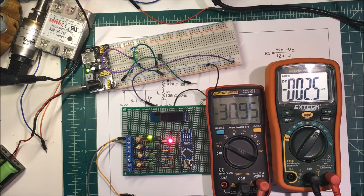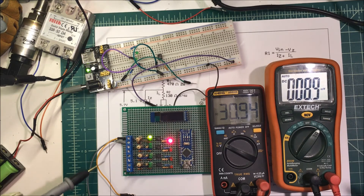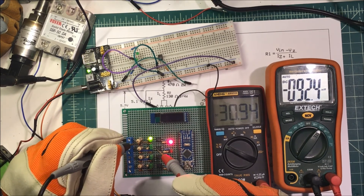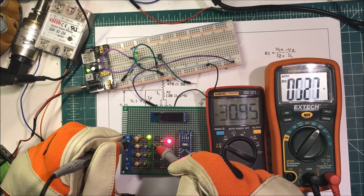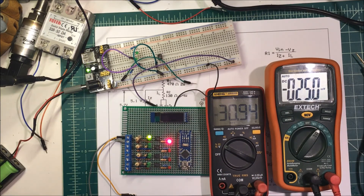All right, here we are. I've got almost 31 volts input and I'll see what we have across the Zeners. It reads 5.8 volts — the Zener diodes do have some internal resistance you have to take into account. Now I'm going to lower the voltage and see. The red diode went out at about 2 volts and it comes back on at about 3.6 volts. So it'll work from 3.6 up to 30 volts.